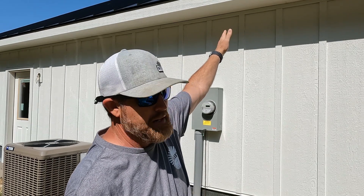What is up everybody, Keith Dykes here with WKD Construction, welcome to the channel. On today's video we are here at the back of the garage on the Melton Farm project and we're going to start running the utilities — the conduit for the electrical and the meter base. I messed up on the editing last week with the meter base and rain screen order, but it happens to the best of us. I'm going to show you how we installed the conduit, the water line, all the way to the road — I think it's about nine hundred feet — where we had to put a one-inch PEX pipe to the meter base.